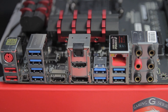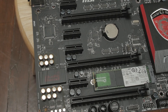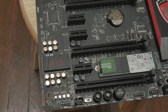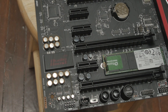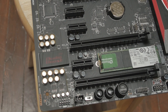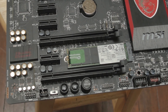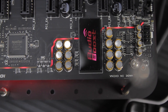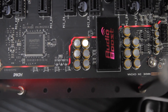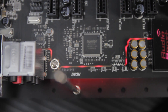The red audio jack is amplified by a TI-1652 amplifier. The front panel audio is also amplified by another TI-1652 amplifier. This setup is designed for headphone impedances up to 600 ohms. The sound chip itself is a Realtek ALC-1150. For the rest of the audio subsystem, they've isolated the audio traces — it's a separate part of the PCB that's physically isolated from the rest of the board. They've used quality Nichicon capacitors and put the sound chip under a metal EMI shield.